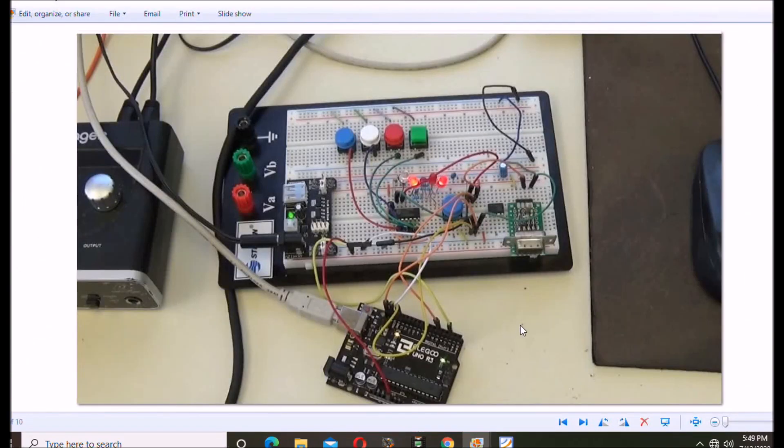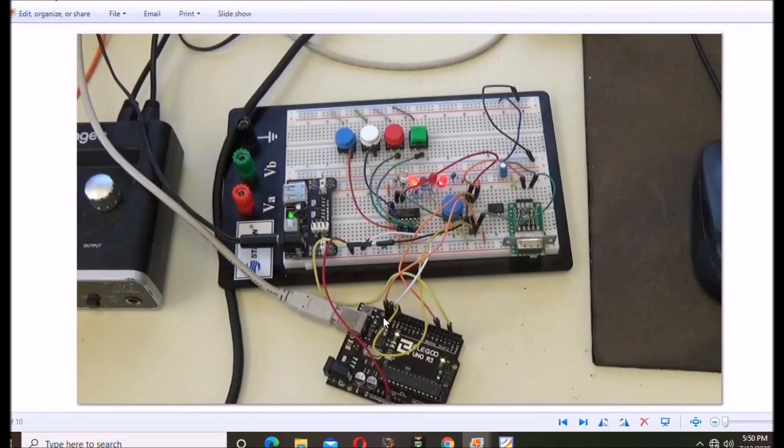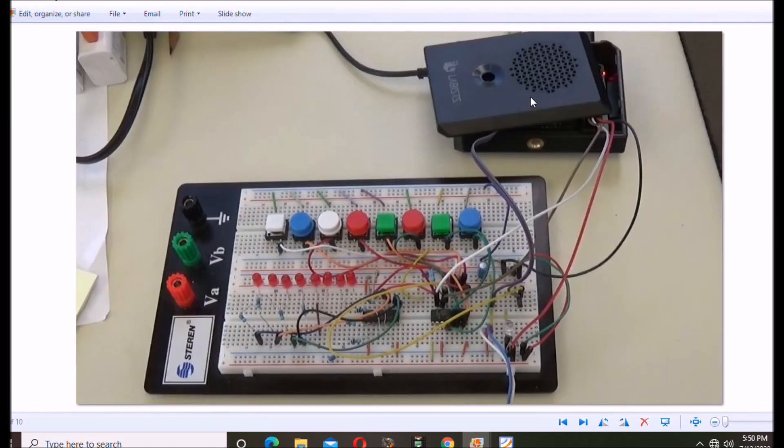Here's a photo that will be presented in more detail in a follow-up video. A PCF8574 is connected to an Arduino or a PICaxe — whichever way I throw the jumpers. I have four switches connected to P0 through P3 and four LEDs connected from P4 to P7. In a later video we'll discuss using the Raspberry Pi along with the Arduino and PICaxe, with eight switches on one device and eight LEDs on another.